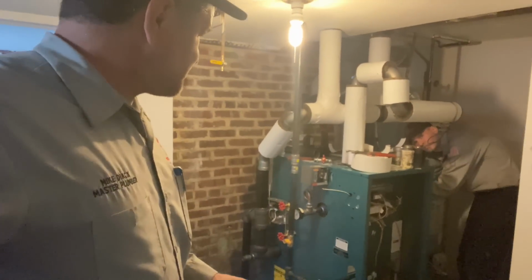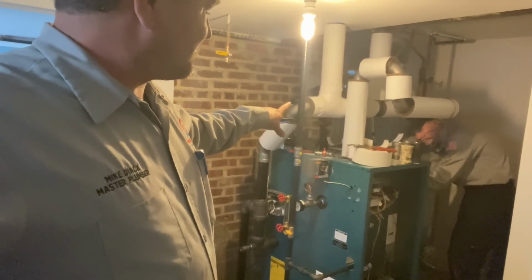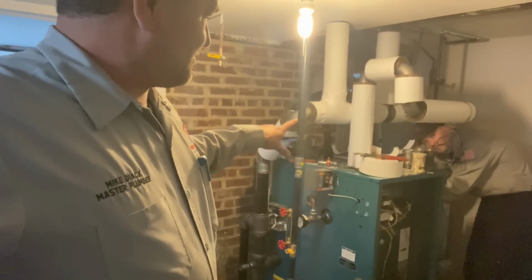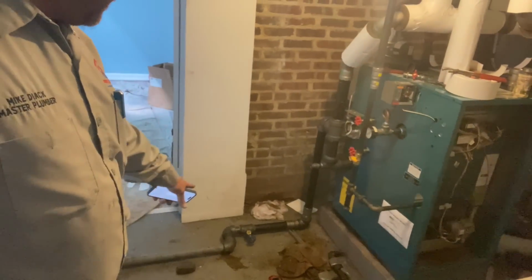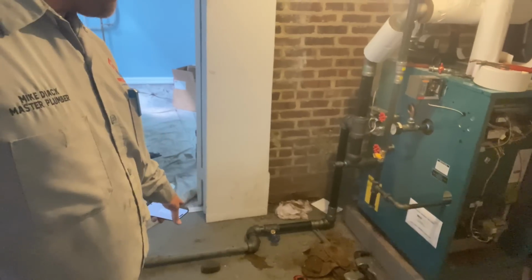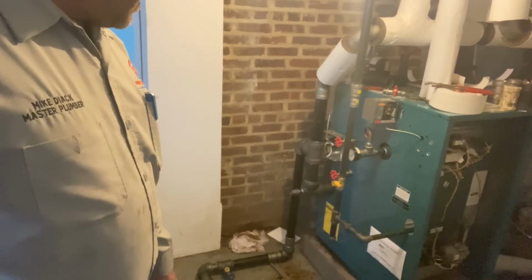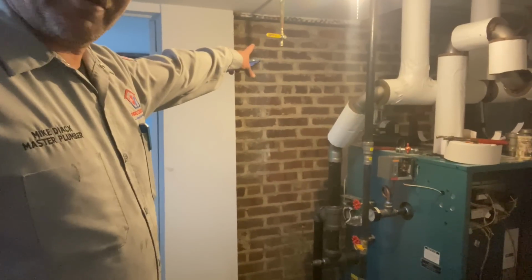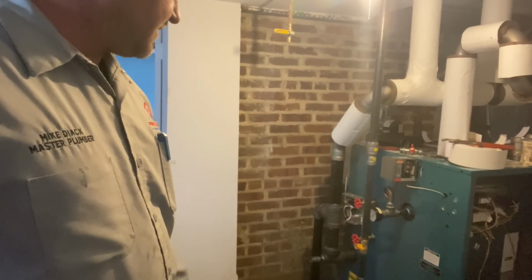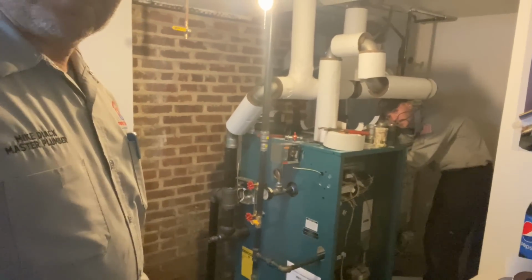Sounds hollow, doesn't it? All right, it may not look like we're getting much accomplished, but we're almost done. When you have the insulation being applied to the piping, and we're gonna put the elbows on, it's really gonna look epic. Mike did a little elbow break there and connected the 1.5-inch wet return. We have a drain right there so we could drain out the wet return. We're going to do our water feeder right there. We're going to connect to our water up there and put the automatic feeder back in. Daniel's working on, I don't know, he's working on something.